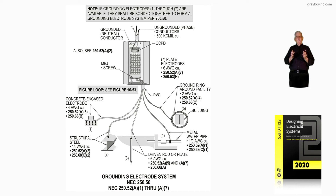As you review this information, notice this illustration talks about a grounding electrode system in accordance with 250.50 — meaning you have two or more electrodes and you have to bond them and connect them together. One-aught is the largest conductor required by Table 250.66, based upon 600 KCMIL terminating to the main in the panelboard. You could take a one-aught and loop it right through and connect all of them together, using it as a bonding conductor — the code says you use the largest one and bond it in.